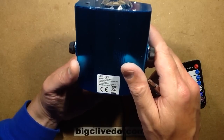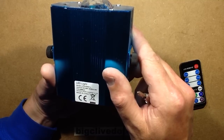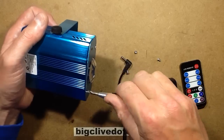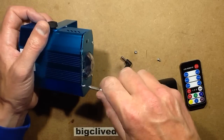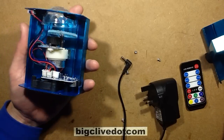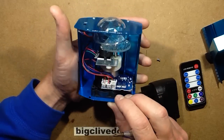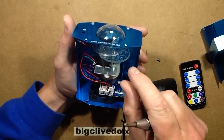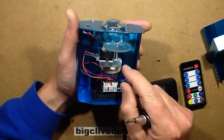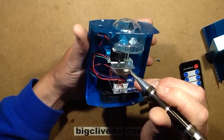This one does actually have a company name on it. It's probably a pretty similar arrangement to the other ones — and indeed it is. The fan is mainly blowing against the circuit board, sharing the same mountings, and everything's plugged together, which is nice. The lens in the front is skewed at a slight angle, which is not uncommon. The usual motor and mounting arrangement — but the LED is not a Luxeon star style, it's different, so we'll have to explore that.